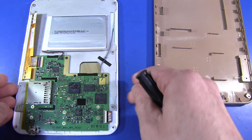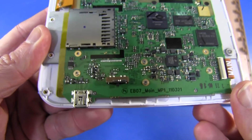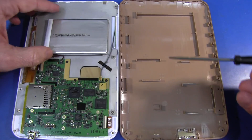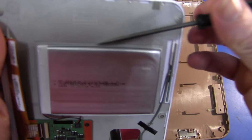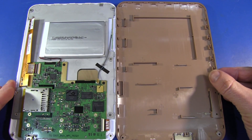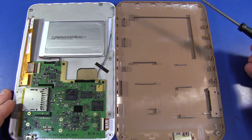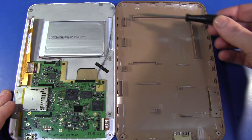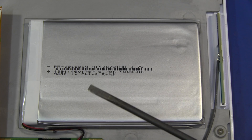The spring itself is built into the slide switch on the main board, so you can still operate the unit with the back cover off. One curious thing is the large amount of free space around here — the battery is not really held in with anything, just sort of stuck down with double-sided tape. I can't see any reason why you couldn't replace it with a larger one of the same type, so that the battery charging technology is compatible. If you actually dremeled out these walls in the back case, you could fit a larger capacity battery in there.